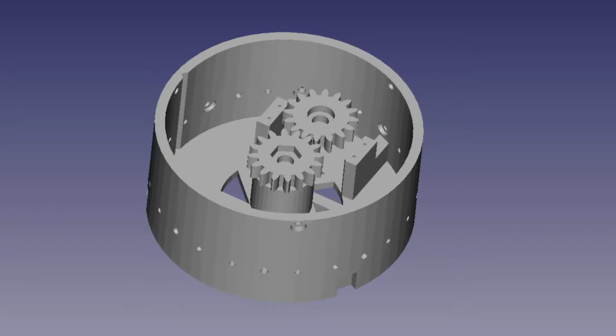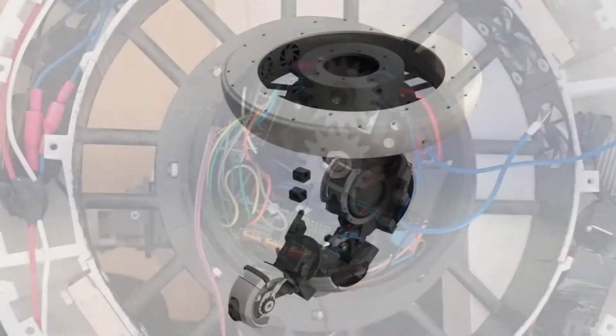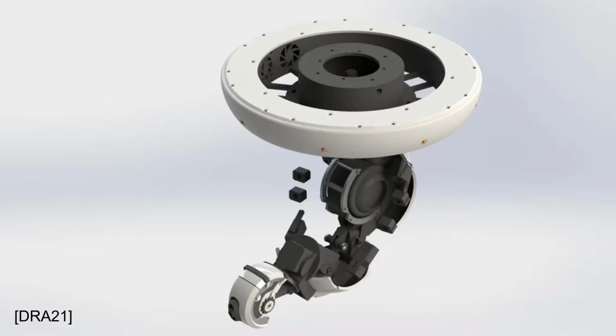It contains the servo and 2 gears for the first axis of GLaDOS, which allows her to rotate around the base. I used this compartment for the microcontroller and PWM driver board, but more on that later. The outer ring consists of 16 individual parts with 8 channels and 8 lids. These channels latch onto each other and are mounted onto the big cylinder using a screw.